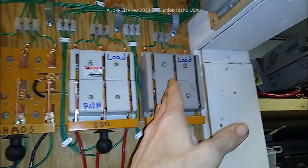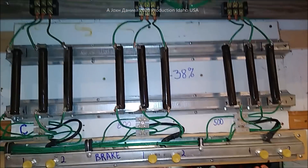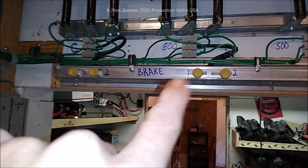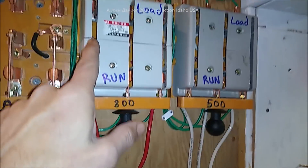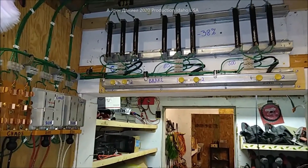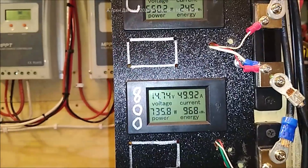These are 10-gauge for that loop, and this is for a 500, 800, and 700-watt turbine — they work beautifully this way. All the parts I can think of, I'll put below. Coming through from the top, through the resistors, short-circuit brake switching system connected to the back side, coming out, back down, and there — same way back down. When that switch is up, you can't get power down to those terminals without doing that loop. Alright guys, I hope that makes sense. 131 degrees — that's a little bit warm, making a lot of power. There we are.